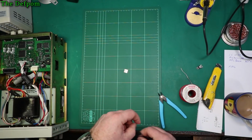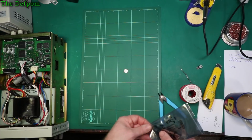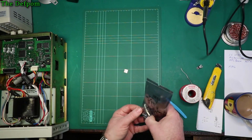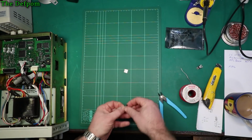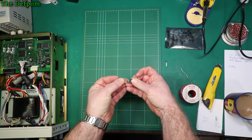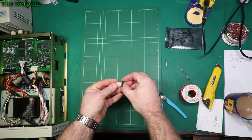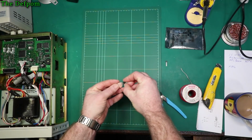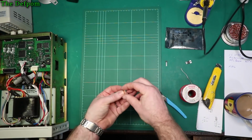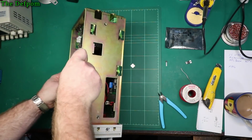So I'm probably going to use header pins with maybe header socket on the main board. That's something I should consider actually, is the pin spacing. Pin spacing is not the same as on the board. It's not the same pitch. So, although it's really close, I might be able to get away with header pins and just bend them very slightly. I probably can do that. Let me have a look.